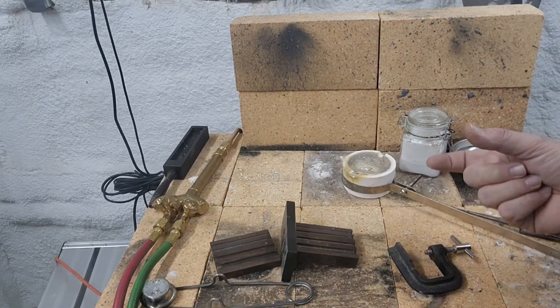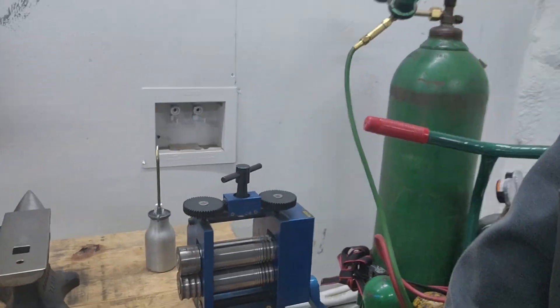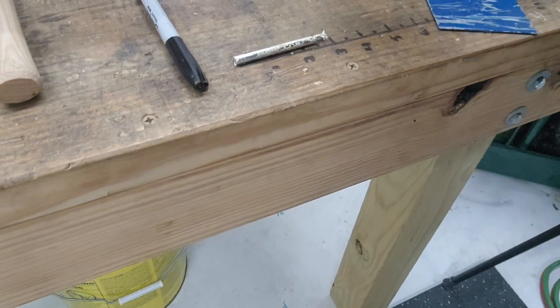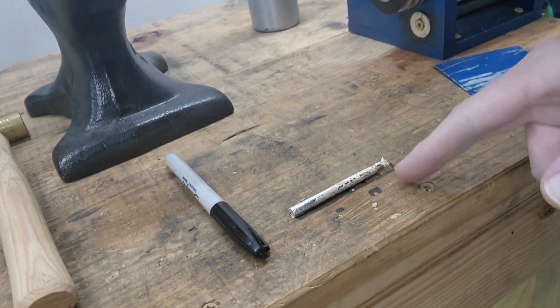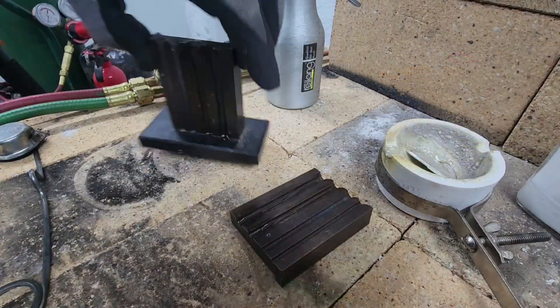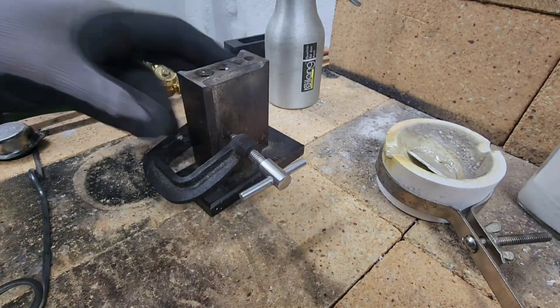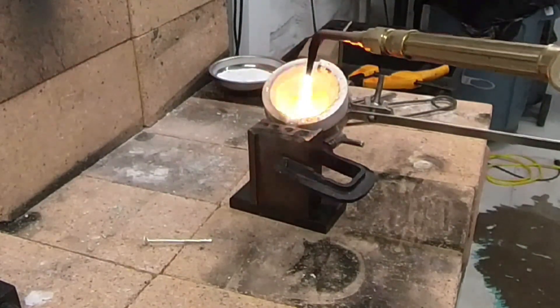I've got the other half of the silver dollar — I like to cut them in half with the bolt cutters and only melt a half ounce at a time in the crucible. It really does matter — I think it makes it easier to manage, pour, and it pours a good-size rod. You don't want too big a rod to start feeding through your mill because you end up with a huge wire that could be a few feet long. I oil my mold — some people use the carbon soot off the torch, but I like to use oil as it helps the silver flow into the mold really fast, especially with a cooler mold if you're not using a secondary torch. I just use machinist oil.